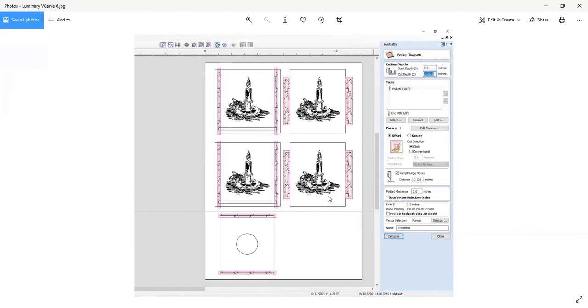And also, because I'm controlling everything, the width of my cabinet from side to side will always be exactly what I expect it to be. And I don't have to worry when I put a string of 12 cabinets next to each other along a wall that the overall length is going to suddenly be more or less than I anticipated because the thickness of the plywood changed. So this is a technique that, although I'm applying it to a very small CNC operation here, you can extrapolate into full-size cabinets or anything else that you're building when pieces have to mate very, very accurately. So that was kind of fun.